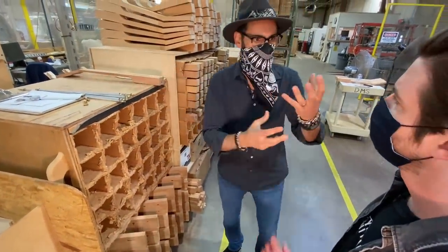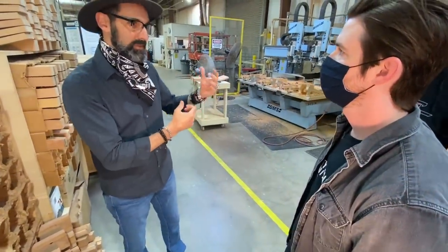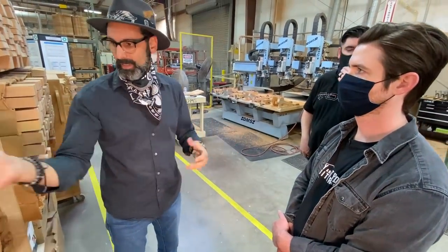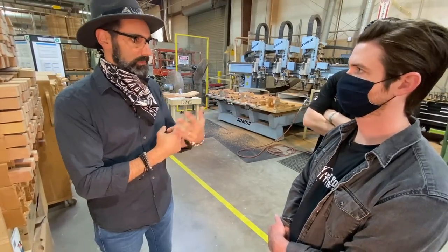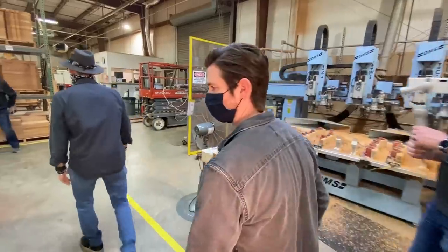And that allowed the necks to get smaller. Before the truss rods, the necks were very big because, you know, to avoid movement. Sure. And once we came up with this, you can go smaller on the neck. Now you've got way more accessibility on the fretboard, and then if it moves, you can adjust it.